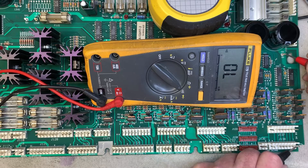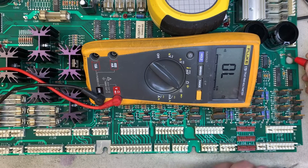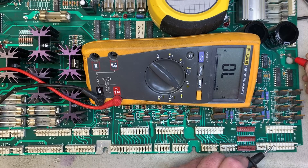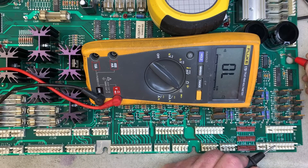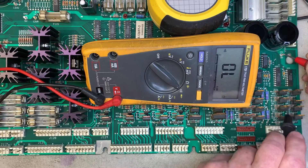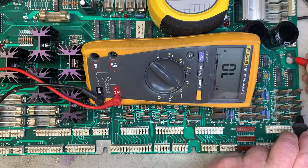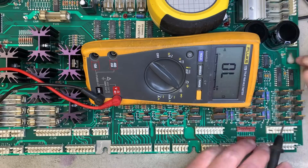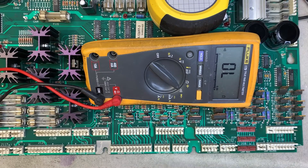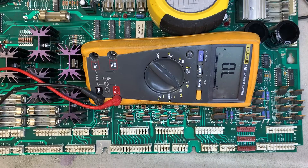You see that? I can do that really fast and you can hear that chirp — the transistor associated with that pin is shorted. I can then narrow it down the old-fashioned way, and it looks like I found it right away. That TIP 107 is shorted. I hope that helps you guys out.